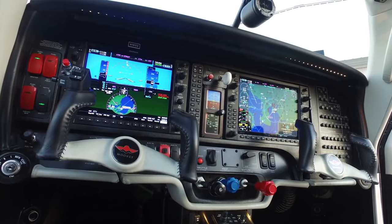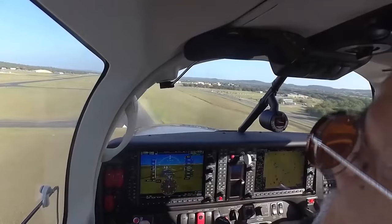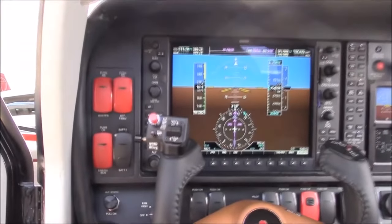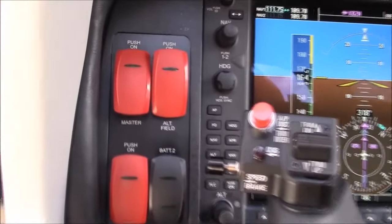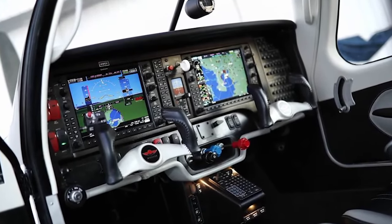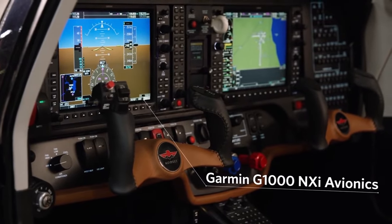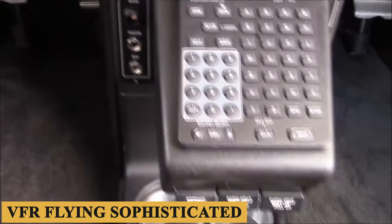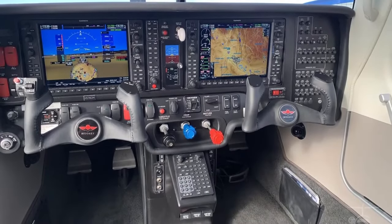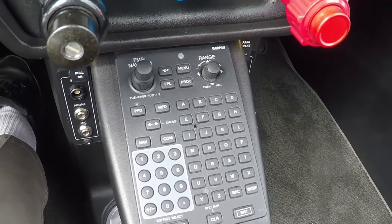In the cockpit, another big change in the Ultra is the new avionics suite. The Garmin G1000 NXI is an evolutionary upgrade to the G1000 suite that has been standard in virtually all new aircraft for more than a decade. Two things about it are immediately noticeable: it's brighter and the screens refresh much faster. It's also quicker to initialize, so no more idling on the ramp waiting for the navigator to find itself. It also sports some additional features, including a pedestal-mounted keyboard for input and a runway approach feature for VFR flying sophisticated enough for the autopilot, the GFC 700, to even fly vertical profiles. The display includes new capabilities such as thumbnail data displays inside the HSI and highway-in-the-sky boxes.